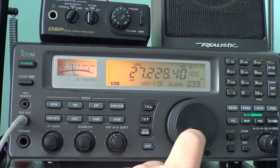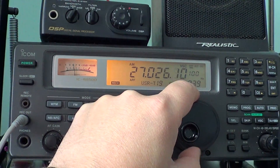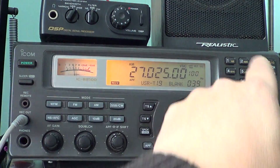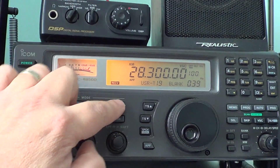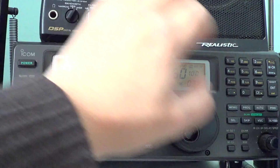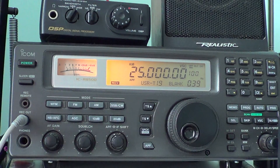This is going to help you understand if there's some skip happening at higher frequencies. If I hear something on 27025, it tells me conditions are there, and I'll be tempted to try the 10-meter amateur band to see if there are stations there. I'll also try tuning from 25 MHz up to 30 MHz. There's a lot of very unusual stuff in that 5 MHz span — not only the 10-meter amateur band at 28-29 MHz, but also out-of-banders, the CB band, and all sorts of unusual broadcasts.